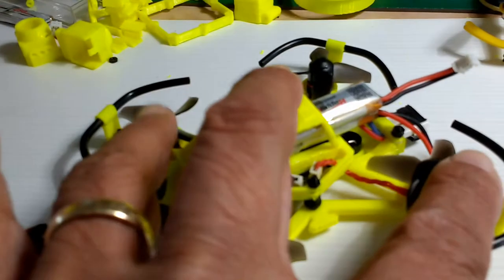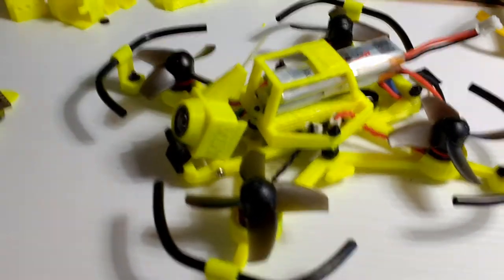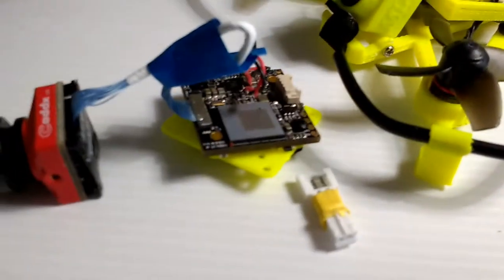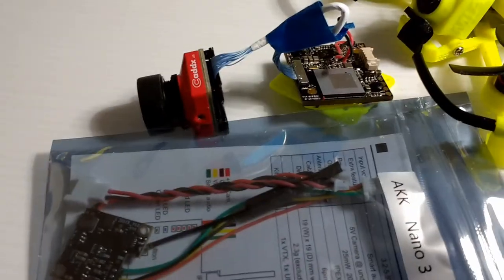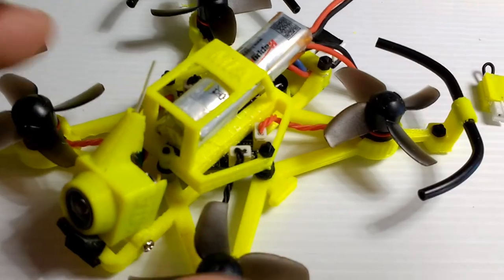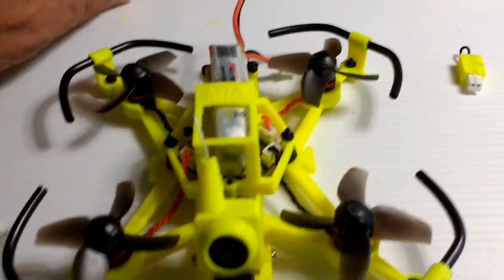I don't want to mount this as everybody else is mounting these cameras on these little tiny small footprint quads because you're really putting quite a bit of weight on this setup. I'll show you what I'm doing with this - I'm doing some really cool stuff in a different frame but still using the same electronics, the same control board, the same motors, because it's very compact and you can't get simpler than a flight controller with the receiver built in. Some of these even have the VTX built into the flight controller, but I will be using a separate VTX with this Caddx setup.